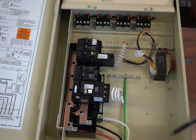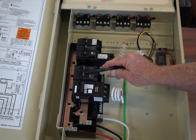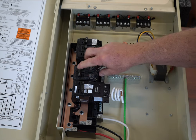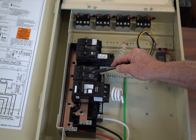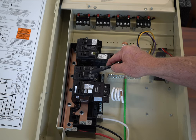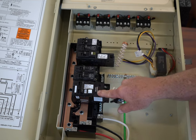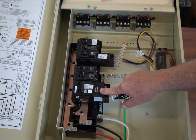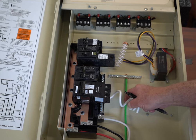There are effectively two different types of circuit breakers. This is what I would refer to as a standard circuit breaker — that would be on, that would be off. This circuit breaker does not have ground fault isolation protection. This is what's called the GFI or GFCI breaker, and it does have ground fault isolation.